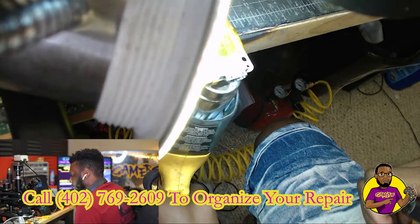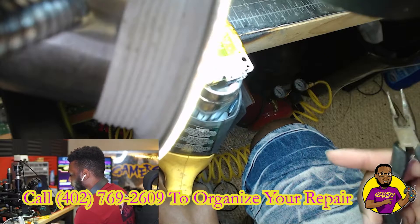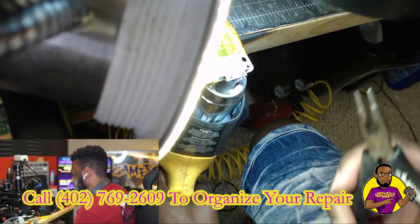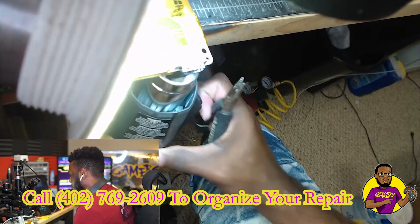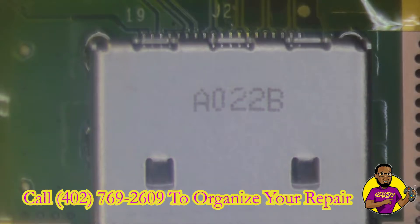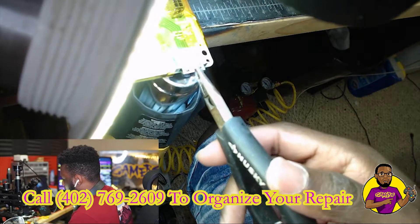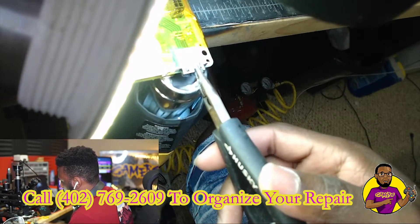What we're going to do is place our heat gun right under the HDMI port like this, allow the solder to heat up, and we're going to have the tweezers in here. We're going to simply desolder it. I'll switch over to the microscope so you guys can see what it looks like. I still got the heat gun underneath — make sure the fume extractor is on as well. Still heating it up. I've got my tweezers and the HDMI port ready to pull off as soon as the solder melts.